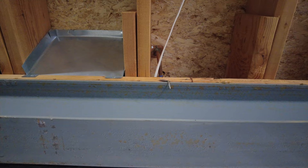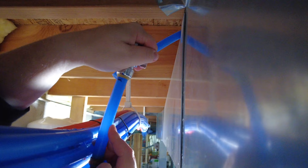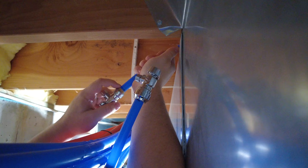If you have PEX lines, it can be easy — just locate the blue versus red lines. In my case, I have PEX and I located the line going from the water supply up to the fridge. I cut it in half and installed two quarter-turn stop angle valves on both lines. The line coming from the water supply feeds into the reverse osmosis system, and I connected the filtered water line from the RO system into a new quarter-turn valve on the new end of the refrigerator supply line. With only about four or five feet of tubing, it really wasn't going to affect pressure much.